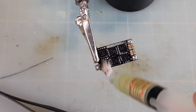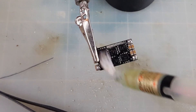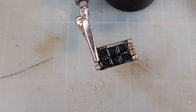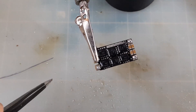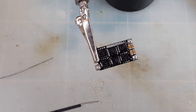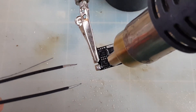I'm setting up my rework station to around 390 degrees Celsius and around 50 percent airflow. The hot air is slowly working its magic. I recommend using a silicone pad like this — it won't catch fire, which is an absolute must in situations like this. It's roughly A4 size, really thick, and very cheap. I'll leave a link below. One tip: don't get white because it gets dirty quickly.